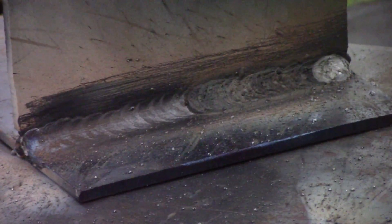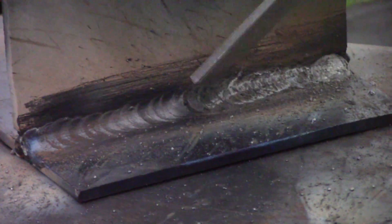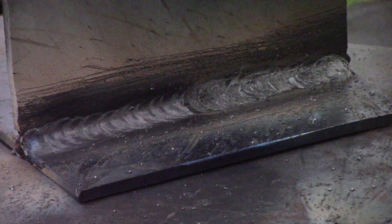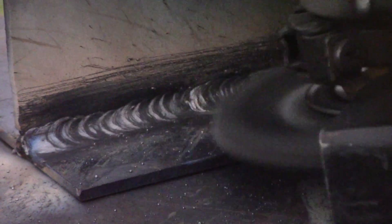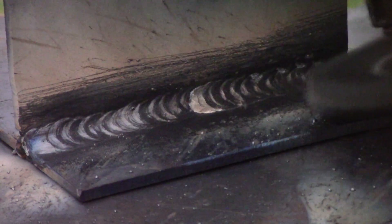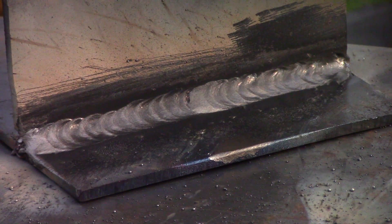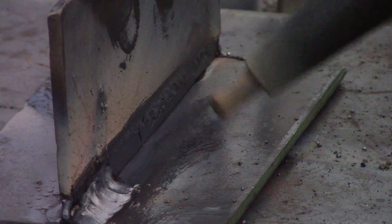The manufacturer's instructions recommend that you straight drag — just pull the trigger and go left to right without any manipulation. The reason they recommend that is you get a lot better penetration when you're not manipulating, though the weld will be smaller. If you want a larger weld for aesthetics or size reasons, then you need to manipulate — but you can just straight drag it. Remember, you do still need to tilt to make sure the slag doesn't get trapped, and that's another reason they don't want you to move the wire — you could trap slag.